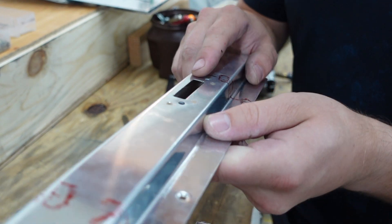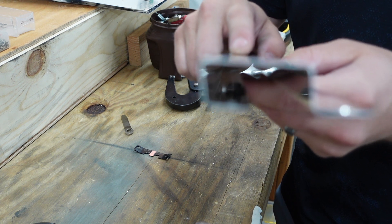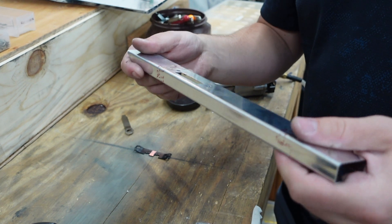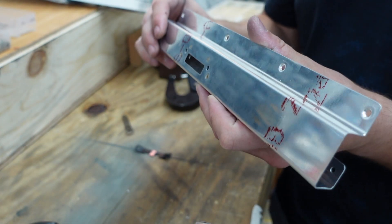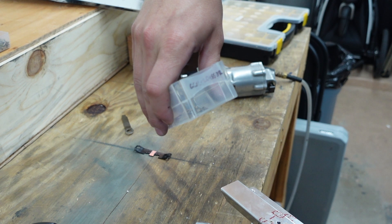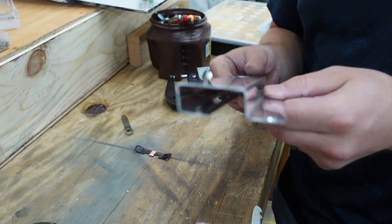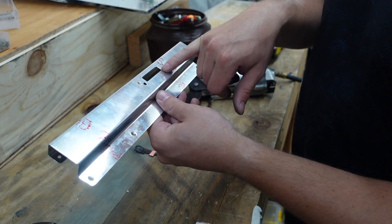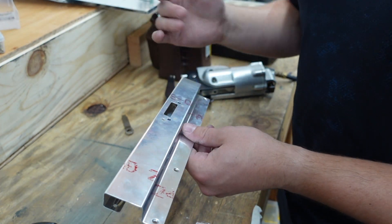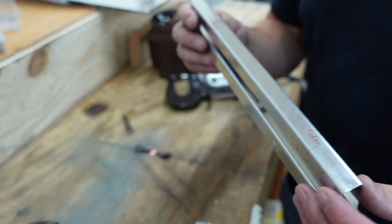There was no way I was going to put solid rivets there. You can see through there — maybe a really thin bucking bar would work, but this being such a flimsy, small, lightweight — I think this is 032 — super thin material, my opinion is I would have just damaged this. So I ended up using CCR 264SS-3-2 rivets, not for structural reasons but for installing nut plates — good application there. Next to it I was able to use solid rivets — just my standard little rivets I've been using for all my nut plates. That way I can just lightly countersink it. I like the look of it, it's nice and clean, no dimples needed.